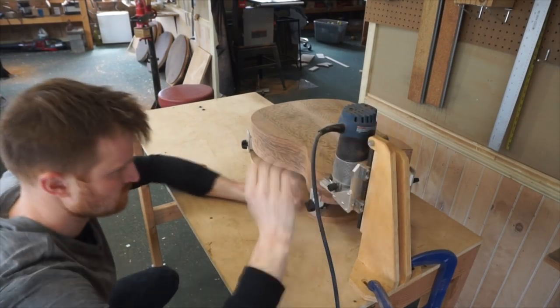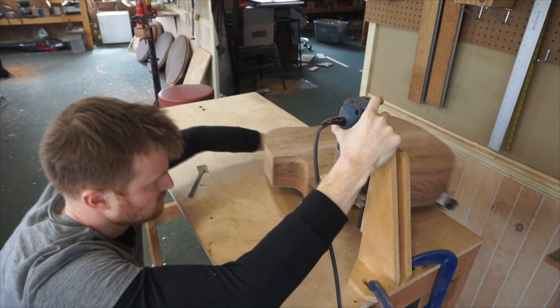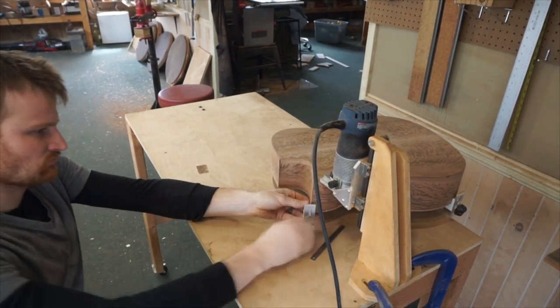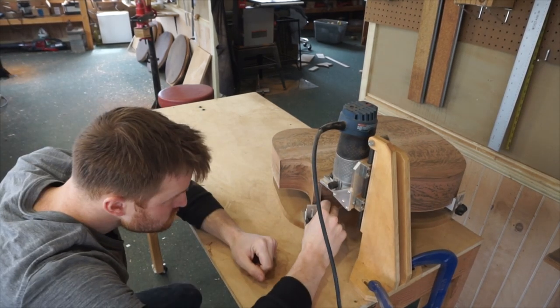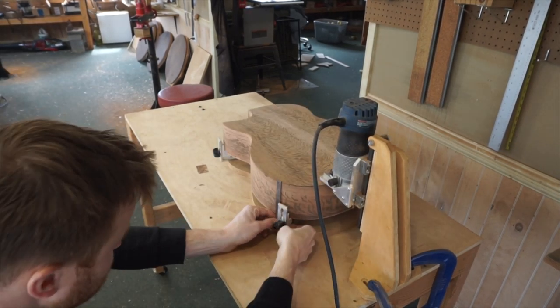And now I'm simply checking the height of the body off of the work table at every corner and setting it so all those heights are about the same. And this is what keeps my channels square. The router at this time is, of course, turned off and unplugged. Don't want to lose your fingers here.